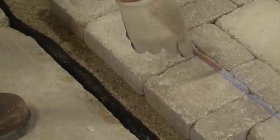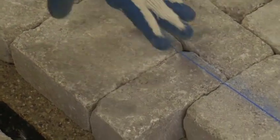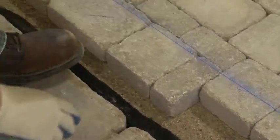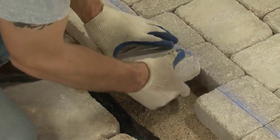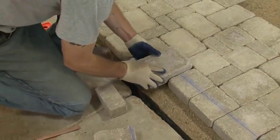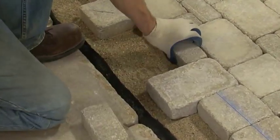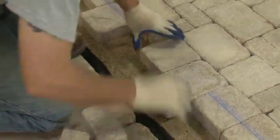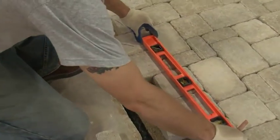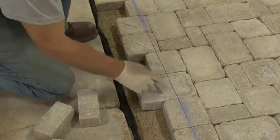When we start running into really small slivers such as these two, it's more often than not better to break the pattern and actually change these shapes out than to cut small slivers like this — they have a tendency to break when we do our final compaction. So what we'll do is pull these two pieces out and use a larger paver and make several adjustments here to get rid of those slivers. Now when we go ahead and redraw that line, our slivers are gone.